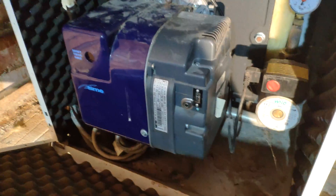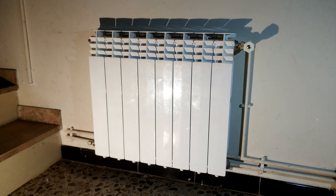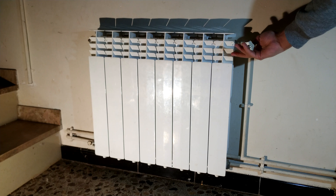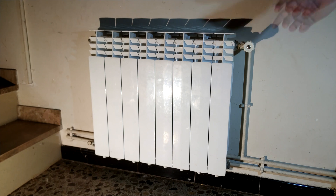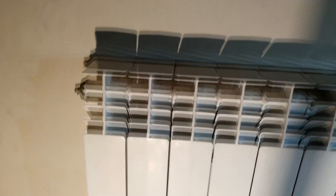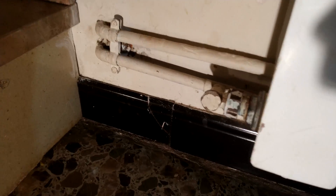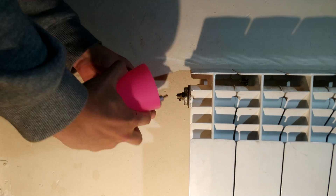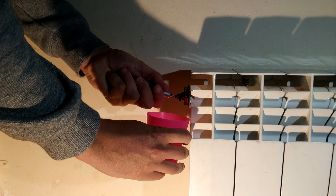This is one of the aluminum heaters I have at home. You can adjust the temperature of this particular heater by turning the valve — this way you control the flow that goes through it. If you want to do maintenance, painting, repairing, or changing this heater, you can close the valve and also the screw at the bottom of the heater.